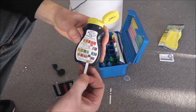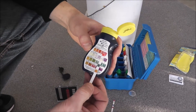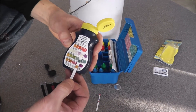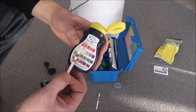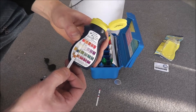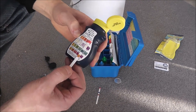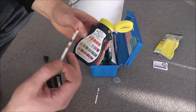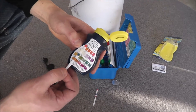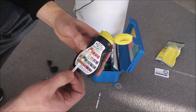The top reading here, we're right around 7.8, maybe a little over — so around 8 on the pH scale, which is high. Free chlorine we're right around between 0 and 0.5. For total alkalinity we're around 200, and for the stabilizer level, the range is 30 to 50 and we are a bit below that.